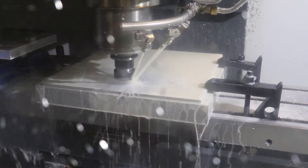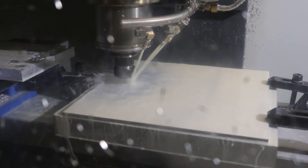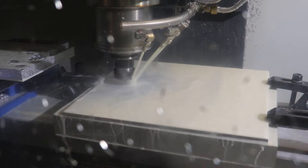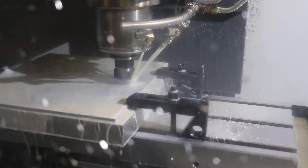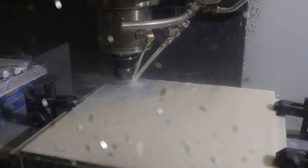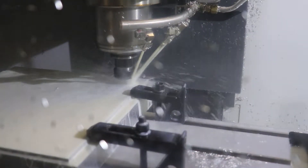This is my first physically large project, and one of the many challenges was making large parts. This orrery is 14 inches in diameter, which means my vise with its 6 inch wide jaws is not going to cut it. So I bought a huge slab of aluminum, which I can secure to the table with step blocks and clamps. You can see I used the clamps to secure an aluminum plate above the aluminum block. My first step is drilling holes in the aluminum plate, which will be used later to secure it to the aluminum block below with screws.